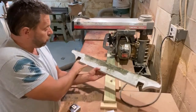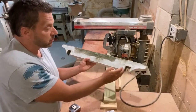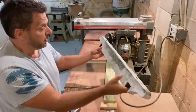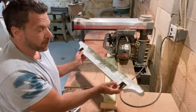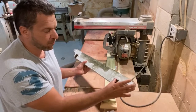For some reason, they chose 21 1/8 inches between the inside edges of these notches, and these notches cap the headers, right? Cap each header. So that's kind of the critical distance there, right? I have to maintain that. The rest of this is a little bit flexible.